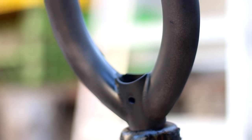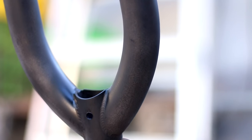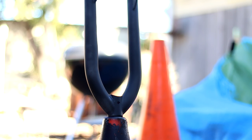That's what I'm talking about — being able to see through it a little bit. Don't worry though, it's just your first coat. You're not going to want to just cake this stuff on. See how it's pretty light — you can still see the raw metal behind it. Wait about 10 minutes before you put your second coat on. The second layer should make it so you do not see any raw material showing. If you still see some, just keep spraying evenly and really get that spot on the third layer.